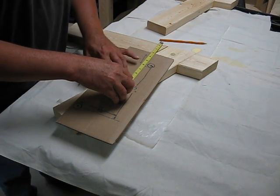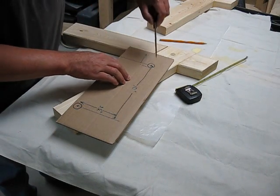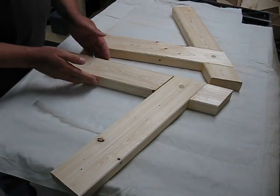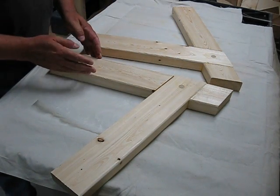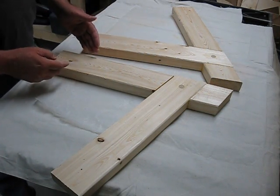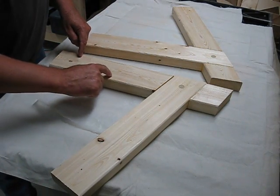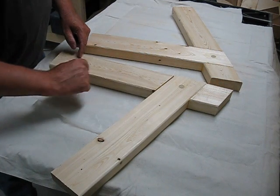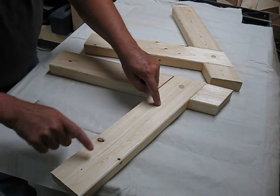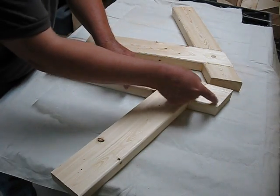I marked a line right in the center of my two by four and put my template on top of it. We wanted the back of the hole six inches away from the wall. These two by fours are actually three and a half inches wide, and I think that's going to be too wide. I'm going to cut it down to two and a half inches, curving up along the edge without touching the strength of the joint, taking a half inch off each side.